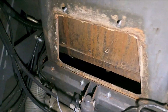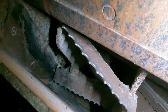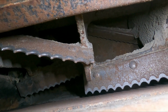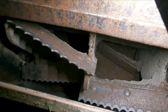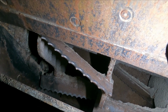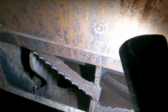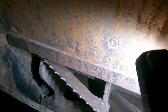The next thing is, while we're in here, and probably the most important thing, is to look for wear in the accelerator. Now, the accelerator paddles, you can see that armored hard metal part of the paddles. That's good. We've got the sharp paddles in with the teeth. These are good for maize. If you're not happy with the throw, you can put the straight paddles in without the teeth. So firstly, checking the paddles.